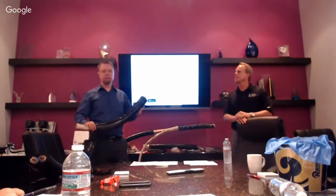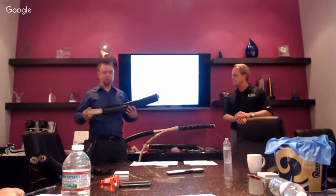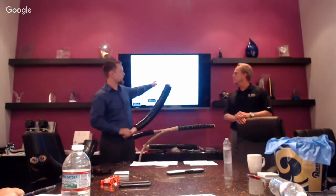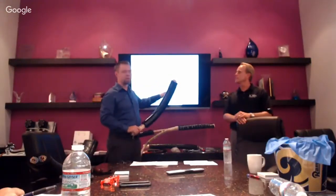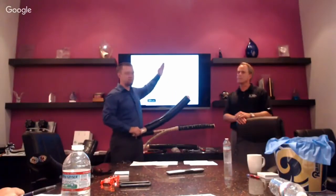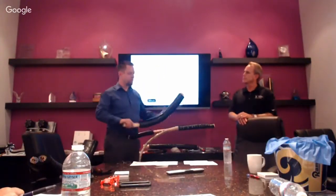It has to get there, but it has to work when it gets there. So the 12 product actually will pull through a nice 6-inch conduit very well because it's being guided nicely through the conduit. You make the conduit 3 times the size. A 12 product line, if it's having a problem pulling through, there's enough room for it to go through and then get bent up as someone pulls.